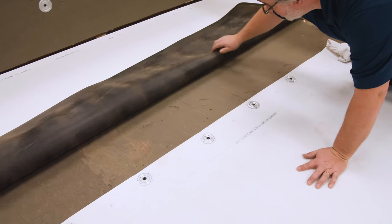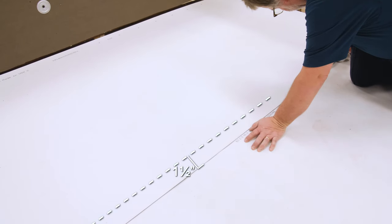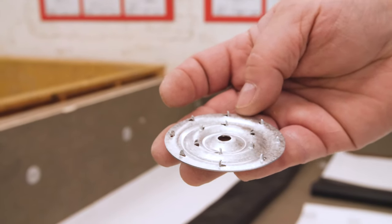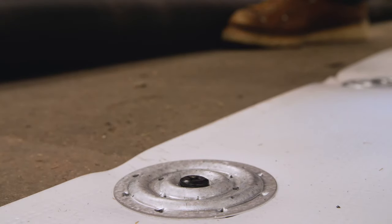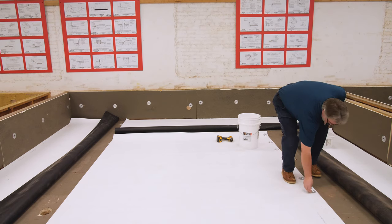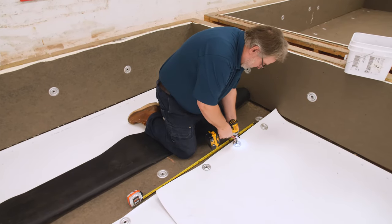When the plates are set on top of the X, the five and a half inch wide seam will provide the required minimum one and a half inch wide hot air weld. TPO sheet must be fastened with barbed 2.4-inch seam plates and number 14 HD or number 15 EHD fasteners. Once the sheets have been set and allowed to relax, fold back the seams and install the seam plates and fasteners as required. Fasteners and spacing are determined by the uplift requirements of the project.